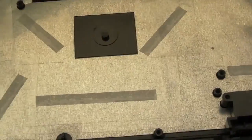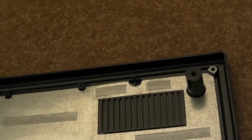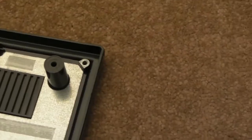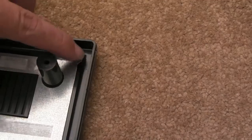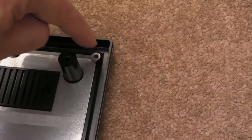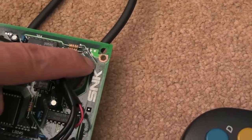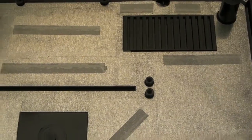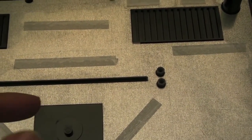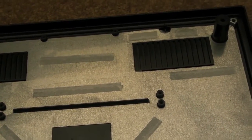It's isolated from the board for the most part. There are still some bits around the edges that still show. But basically where the shielding connects to the ground - that was the point where I noticed this problem first. As soon as you put the screw through the main board into that shielding, because if you look at the main board there, you've got a connection point that connects to ground - as soon as that screw went in, that was when the problem started where there was some graphical noise. So when you had the diagnostic bars in - but since I've done this work, this has been perfect. It's been absolutely rock solid.